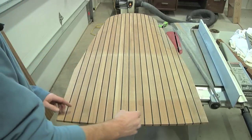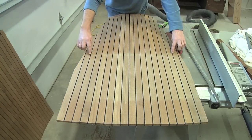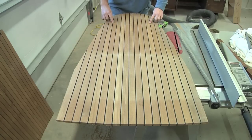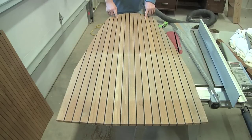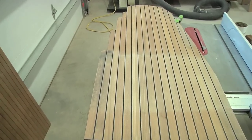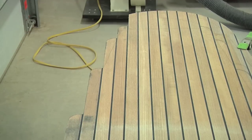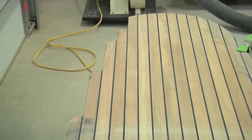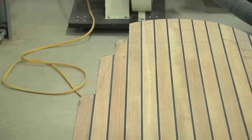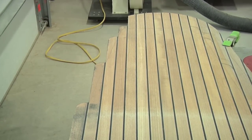I've gone through and measured on either side so that each nib coming in is symmetrical. As you can see, here's the first one, coming into the second, again on the third, and then as we get towards the bow — the very tip — the final fourth. I've gotten the first side cut out, and if we zoom in you can see what I mean about the nibs. I've gone through and radiused the end of each plank where it's going to be butting into the side border trim. This is a really nice transition to do when you get to the end of the planks as far as finding a way to terminate them.